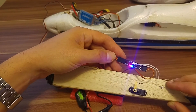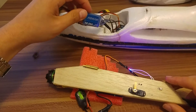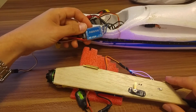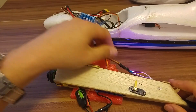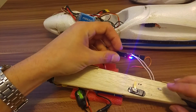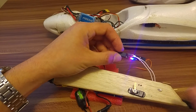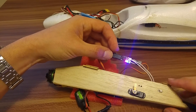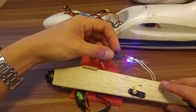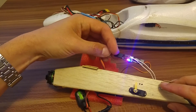The minimum value of the throttle is the minimum as possible. If you have an ESC like this one which is armed on the first try without even touching this menu, that means you can skip this section by pressing long press right now. That will set this to the minimum as it was. But here we have a problem, so we want to make it higher. We will press a few times until the motor will arm — this will make the throttle higher every press.